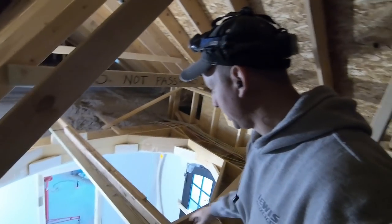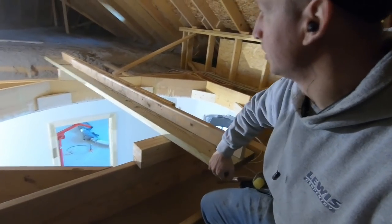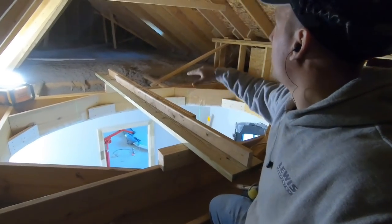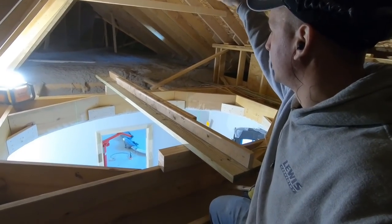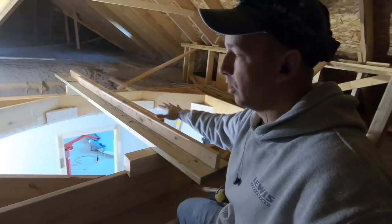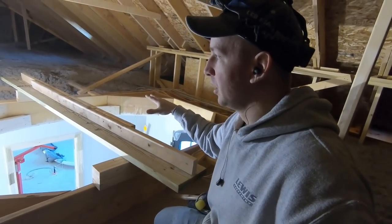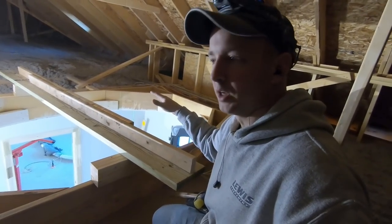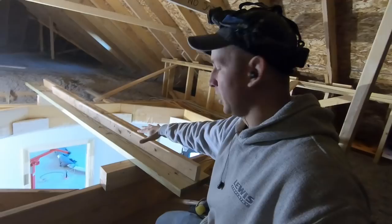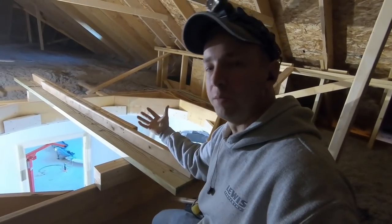I blocked three scabs of 2x4 up on both sides and I've got a 2x10 spanning across this, which gave me something to walk across to mount my winch. I've also got it blocked up high enough that it'll actually be above the top of the dome. This dome is going to have a light in the center of it, so I'm thinking of the electrician — I plan on leaving this in permanently and adding framing if needed.